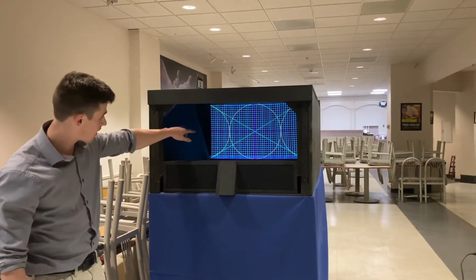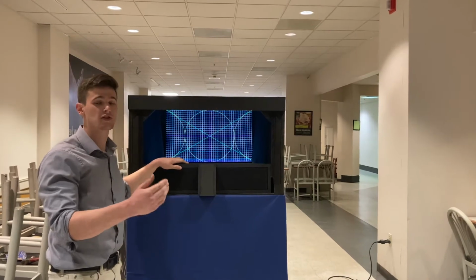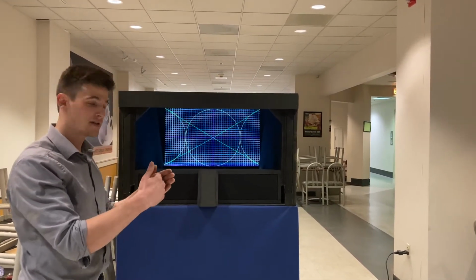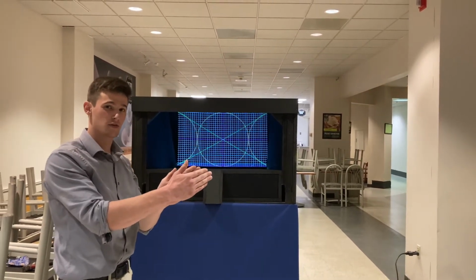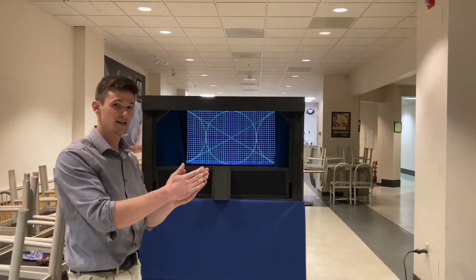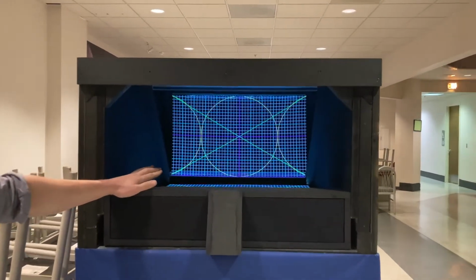And then up here is displaying a grid. When we had the original 1/2-inch thick acrylic panels, there was a double reflection on the front side and back side of the panel. So we had to take that down, and on those panels you could see 2 of these grids lined up and offset a 1/2 inch, the width of the panel. But we had to go back to thinner panels. We're at a 1/16 of an inch, and you can't see that dual imaging. If you zoom in onto the grid, you just see a single grid with no double reflection.